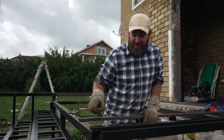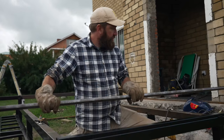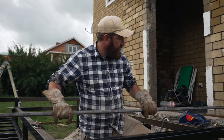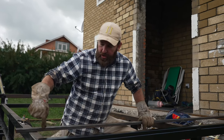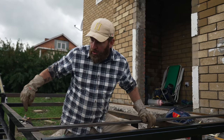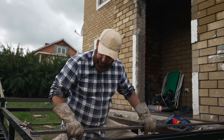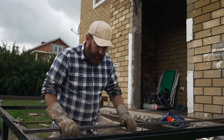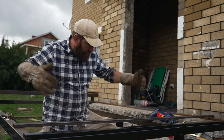The last thing before we put on the deck boards is the joists — these are our 2 meter 30 joists. What I've done is measured 30 centimeters on each pole all the way down, which is going to make it 10 joists. I'm just going to put it on there, clamp it down, weld it in — maybe do two — and then Zule is going to come and paint, and then we work our way down.